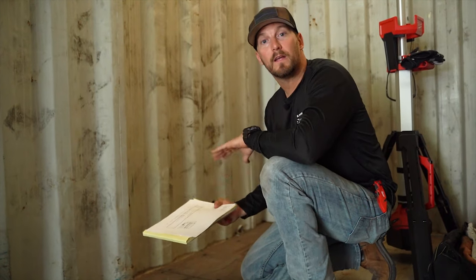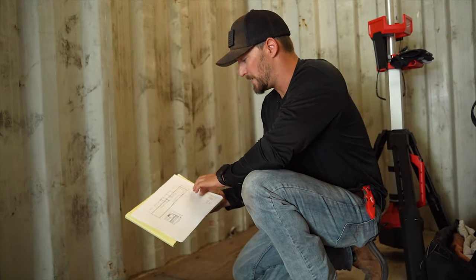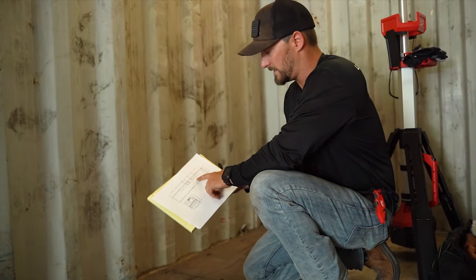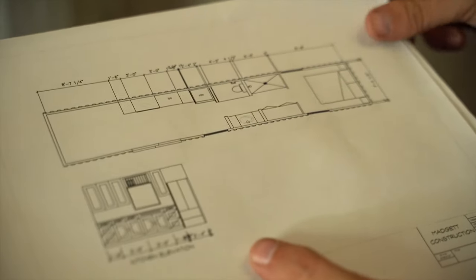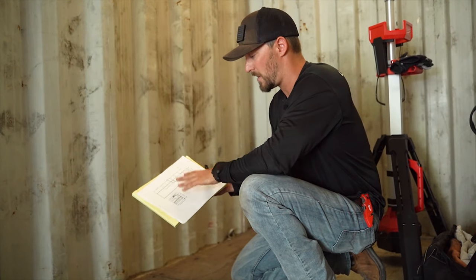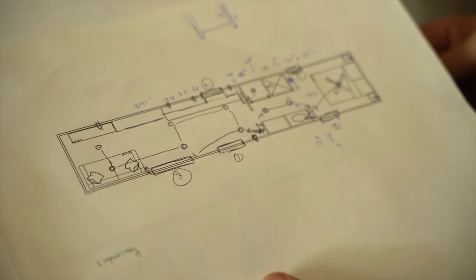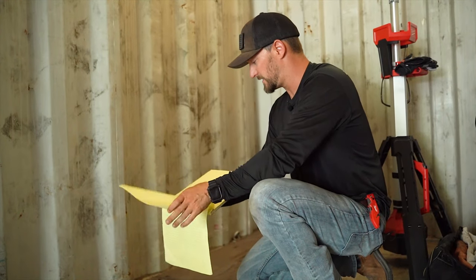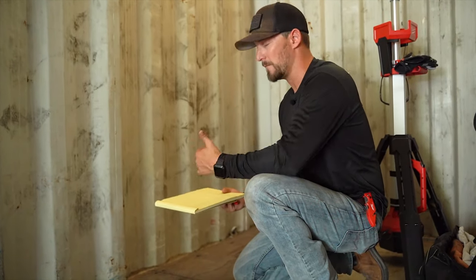What we're going to do is begin looking over our preliminary plan that we drew up. We were working off of some basic rough dimensions of interior space, but we can't take these as our solid dimensions because we've got to factor in insulation, framing, and drywall — all those calculations are going to start shrinking the size of the room. What I have is CAD, but you don't have to have CAD — it could be a simple ruler-drawn plan on an empty piece of notepad. Then come out and lay out your walls.